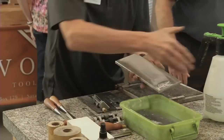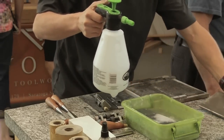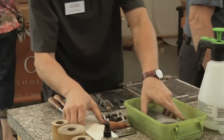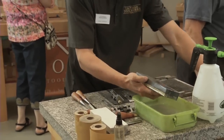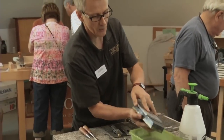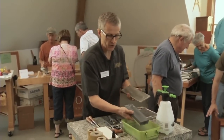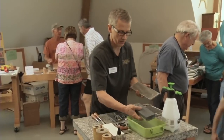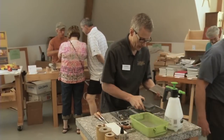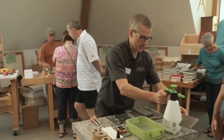When the pencil lines have disappeared, the stone is flat. As a matter of good practice, just flush the flattening stone off. You'd do that to both stones — typically the coarse and the fine. I like to start with the fine stone and end with the coarse, just so I don't mix coarse grits into my fine stone.